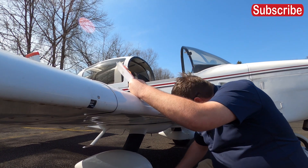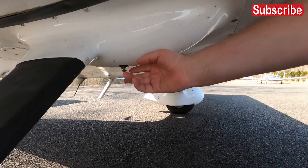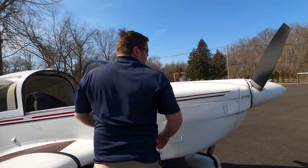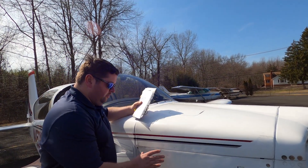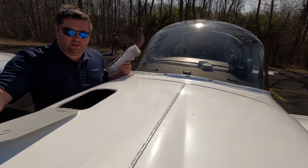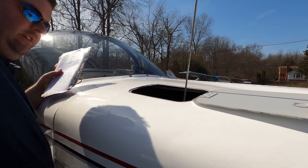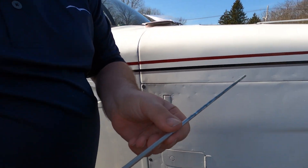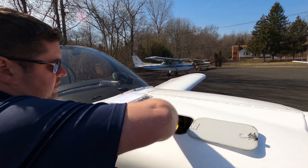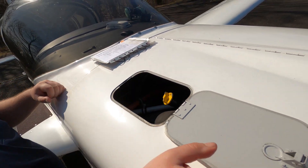If you're going to fly for real, there's a fuel sump right by the right main landing gear where you would insert your fuel sampler to check for contaminants. Unlike the Cessna, some low wings — including this one — you can pop open the engine cowling to inspect the works. I can also see through the oil access door right here. It's a little hot because I just flew it. Looking for proper oil level — it looks like just over four quarts, which is good. I also use this chance to peek in the opening to make sure nothing in the engine works concerns me.